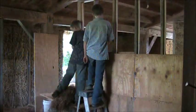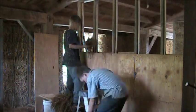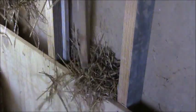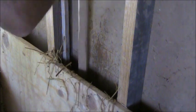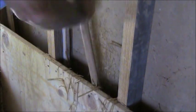Just keep packing once you've got it up at that level. You may need something to stand on and a bucket to hold your straw. A key technique is to not put too much straw in at one time — too large a handful will wad up, get caught, and leave voids in the wall. Too small is better than too big. Push straw specifically over on one side against one key, then on the other side against the other key, or spread it loosely toward the outside edges, since straw will accumulate more in the middle anyway.